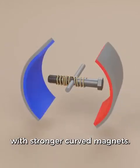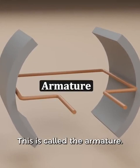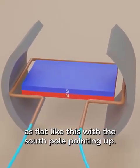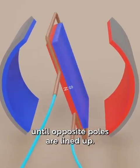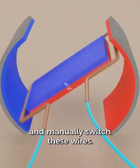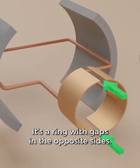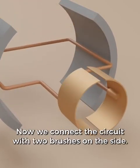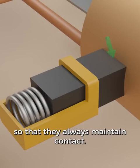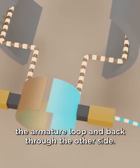The two side magnets can be replaced with stronger curved magnets. And instead of a bolt with wires, we're going to use a metal loop — this is called the armature. Connect our wires and we have a circuit again. You can think of the electromagnet as flat, with the south pole pointing up; the armature will spin until opposite poles are lined up. We can keep it spinning by switching the wires, but this is a lot of work to manually switch them. We need to add something to the armature called a commutator — it's a ring with gaps on the opposite sides. The commutator will spin along with the armature. We connect the circuit with two brushes on the side; these brushes slide along as the commutator spins and are spring-loaded so they always maintain contact. The current flows from the wire through the brush, the commutator ring, the armature loop, and back through the other side.